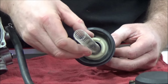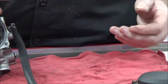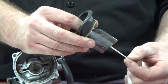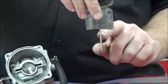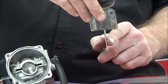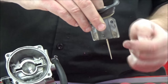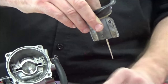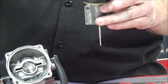Now I'm going to put my spring in here, and then I'll put my finger on this assembly to hold it. On all these slides, there should be a little bit of spring tension and it should not be rigid. See how this is flopping around a little — that's a good thing. If it's rigid or side-loaded heavily, something's wrong. There may be a burr on the slide or needle, or it's cocked. You need to have that play in there — that's inspection number one.